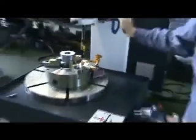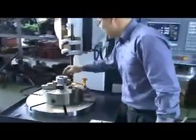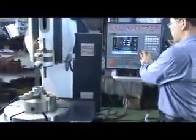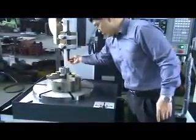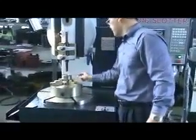Then you compare, use this way to compare and adjust the X offset until it's okay. Use this way to adjust the tool holder and the center. Then after you install the cutter wheel and the floating bar wheel, everything is okay. In the workpiece, you test the workpiece here.